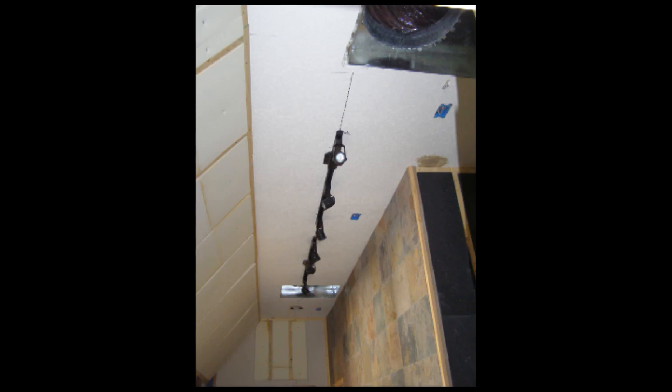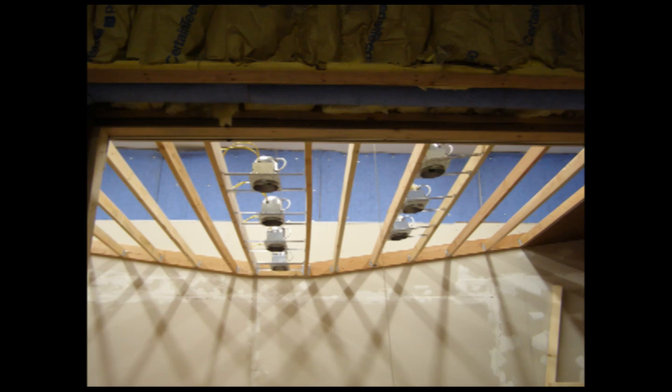I only recommend four types of lights. Track lights are my favorite — they are directional, put out no EMR, and produce no vibration. Pendant lights are nice, and wall sconces are kind of classy. Ceiling lights are also good. Recess cans are okay, but if you use them, apply silicone sealant on all the mounting rails and movable parts. Otherwise, when your volume reaches 11, you're liable to get vibration from them.